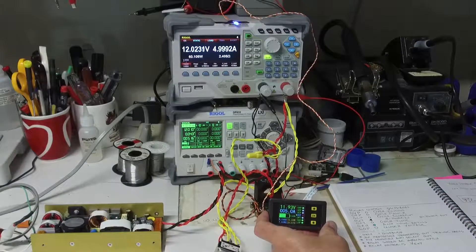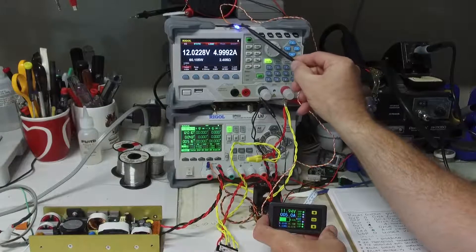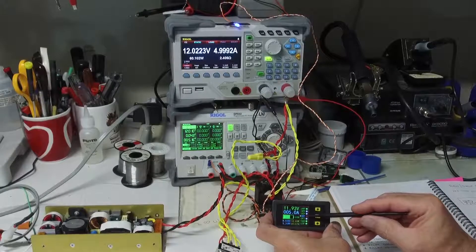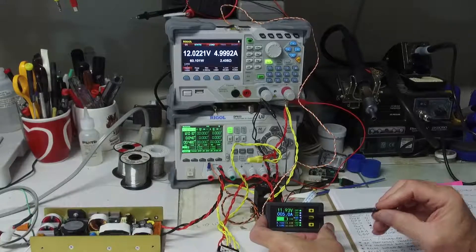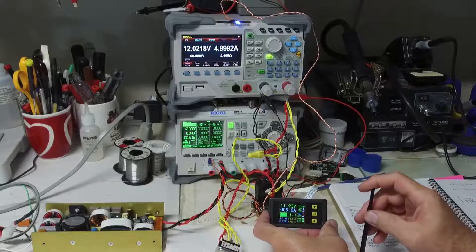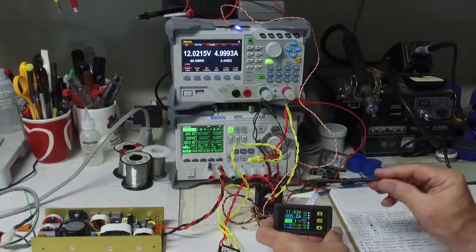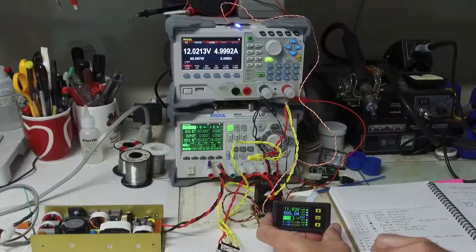You might have noticed there is a blue LED right here on the very top of my electronic load, and that is tied to the relay output. It's lit right now, which means it is turned on, and that indicator here is lit indicating the LED is on. I can turn that off — indicator is not lit, LED goes off. So if you're using a relay, you would want to use a normally open relay, and the relay is powered by the same voltage supplied to this meter, which right now is 12 volts.